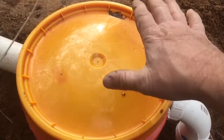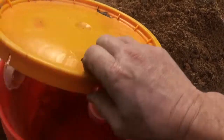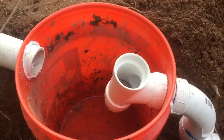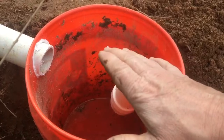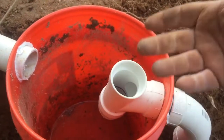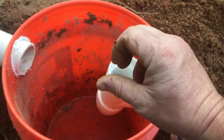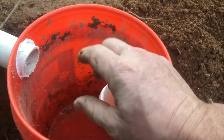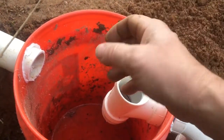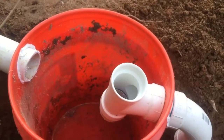There are a billion different ways to decorate around it or cover it up — even one of those fake rocks works great. Once a year you'll want to uncover it, take the lid off, and scoop it out: get the grease off the top and scoop the solids out of the bottom. Or use a shop vac to suck it all out.